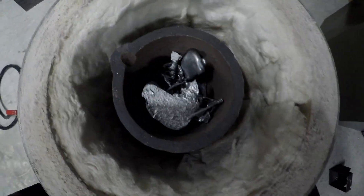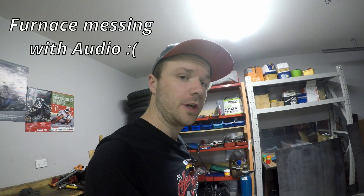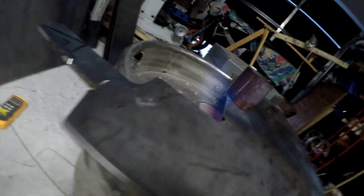All set for casting attempt number three. I have weighed out aluminium ready in the crucible and our mold is in the kiln — I've had that on for a couple of hours so there's no chance it won't be up to temperature. We're approaching melting temperature and so far so good. Now I do have a question: there's a blue flame coming out of the top of the furnace, and it doesn't do this until about 440 degrees, then the flame goes from inside to outside. If anyone knows, leave a comment down below.